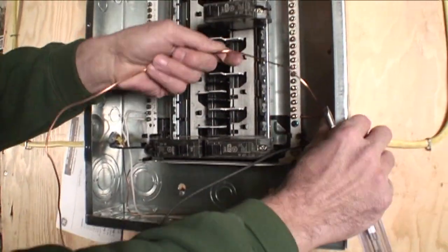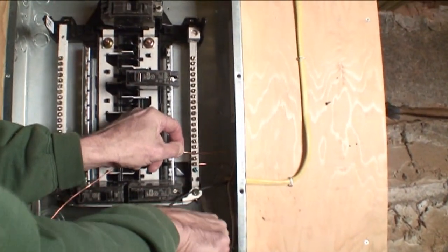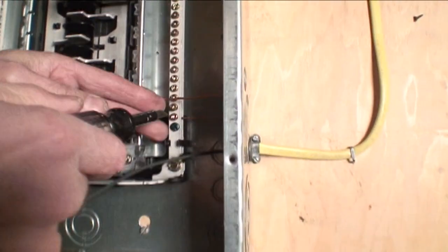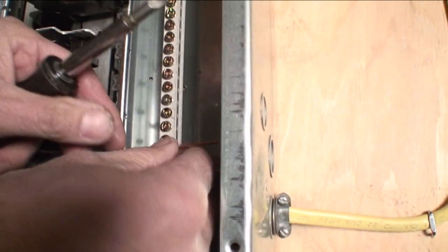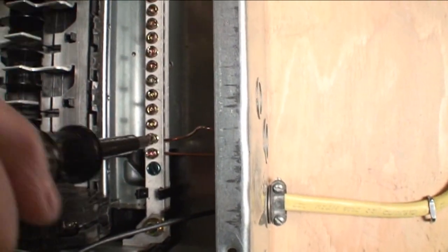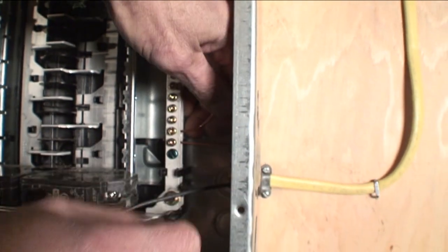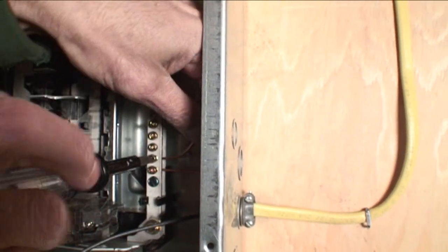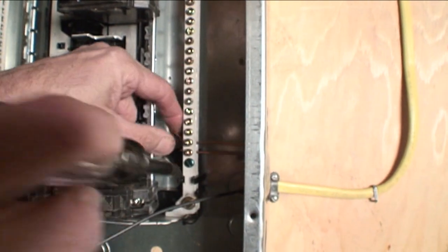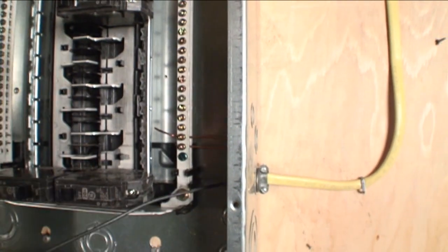Now we've got the ground lead. The ground lead's going to this side — making some nice right-angle turns. We're going to clip that wire right here, loosen the next bus bar connection, and there's the copper wire. We can bend it a little bit, get it in the hole, tighten it up, then push this back. We don't need excess wire in here, and again we have this luxury of not worrying about electrocuting Tom, because there's no power in this panel.